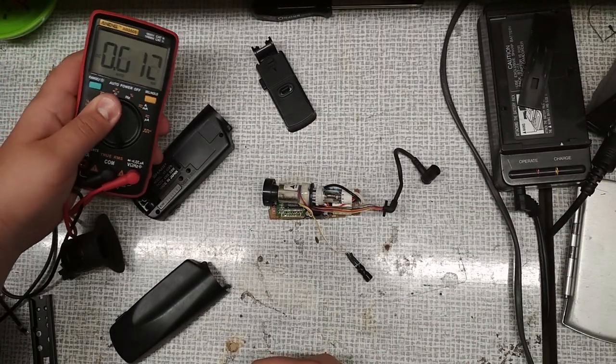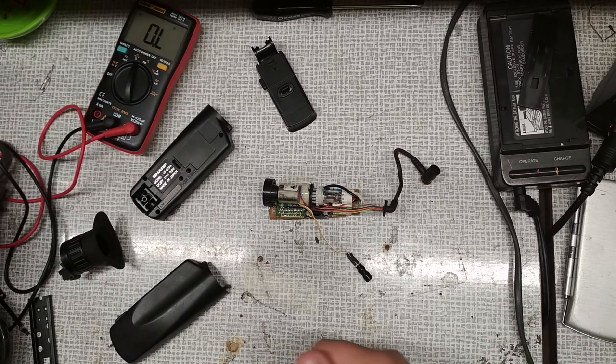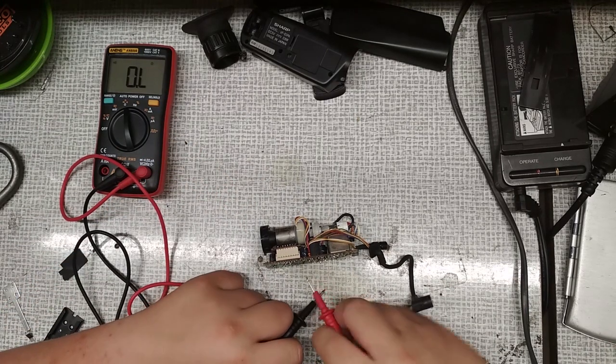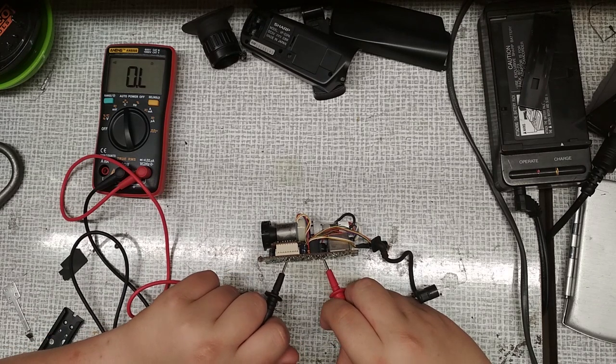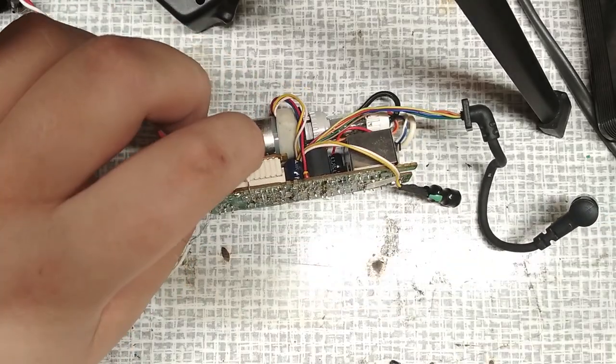It's pretty easy - all you need is a multimeter with a continuity tester. First, to get the ground pin, just find a capacitor on the board and put one probe on the negative side of the capacitor, and with the second probe just touch around pins and it should beep. Congratulations, you found the ground pin. Now do the same and find the positive pin. Solder two cables to those pins and connect it to a USB.